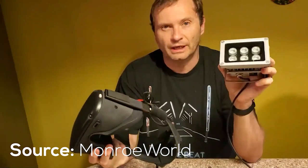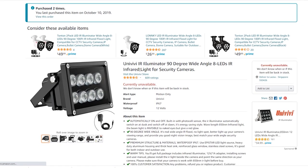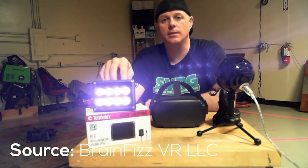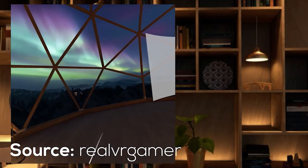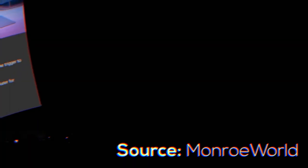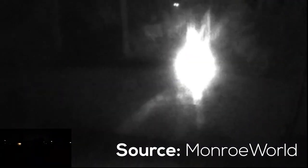What I've done quite a lot, every time I went to an event, in order to make sure no matter what kind of venue it was, I brought one or perhaps sometimes a couple of what we call infrared illuminators. An IR illuminator is absolutely a must-have inside of your toolkit if you are using inside-out tracking with LED infrared technology. The IR illuminator will be able to do two things: first, it will be able to tell the VR headset that there is a light source and be able through the algorithms to calculate where it's positioned in relation to where you are. Secondly, it will send out the amount of photons required especially in darker rooms, so that it will augment the tracking and ensure that you don't have any issues of any kind.